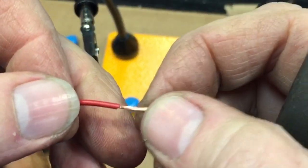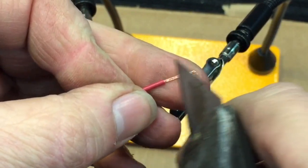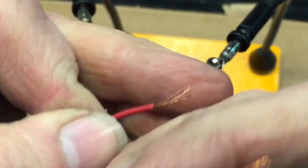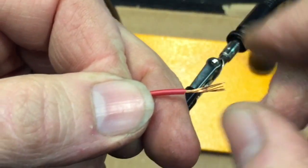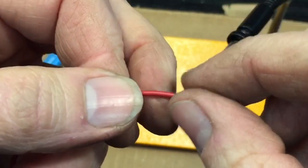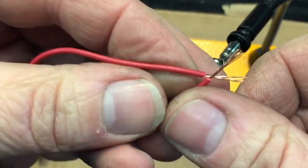Okay, let's get to soldering. First we're going to try this thin wire. Sometimes when you don't know if a wire is clean or not — copper is super bright and shiny when it's clean. Here I'm scraping off some of this wire, and you can see the difference. This wire was covered with a vinyl covering, but it can still tarnish underneath. That tarnish makes it much more difficult to solder, and that's where the flux comes in.